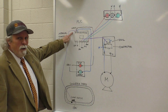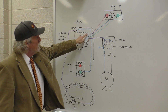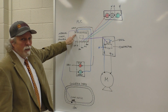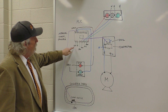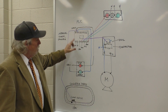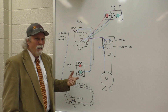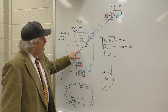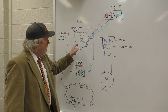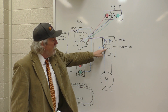The inputs are on the top part of the PLC: input 00, input 01, input 02, and so on, with a neutral on the input side. On the bottom, power comes in — 120 volt and neutral — to power the PLC. The outputs are output 00, output 01, output 02, output 03, and more — I think there are about eight outputs. We needed 120 volts on each one of those, just waiting. When the internal switching hits, it will send power out. Output 00 went to the motor — to the coil of the contactor and the mag starter — and once actuated it would feed power to the motor.